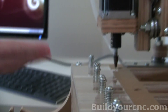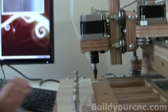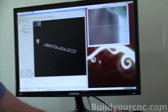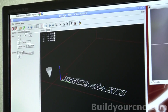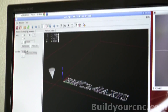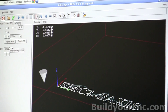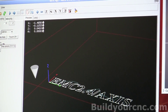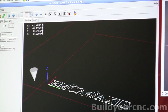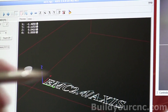Next, after this, we're going to do compensation of the actual A rotation degrees. So now we know the nozzle X position is at negative 1.4650 and the Y is at negative 0.1153. Now what we can do is subtract the X's and the Y's, find their deltas, and we know the displacement from the camera to the nozzle.